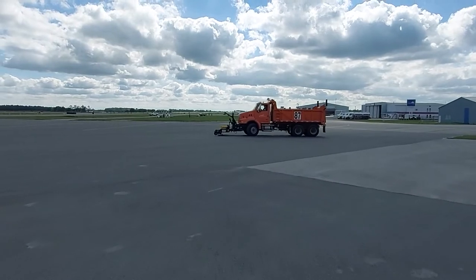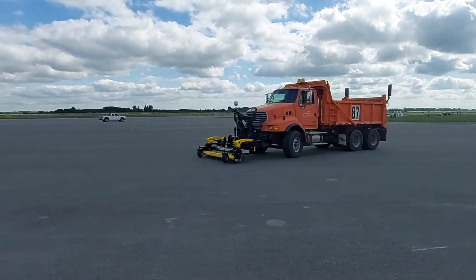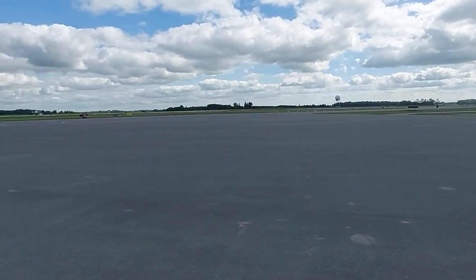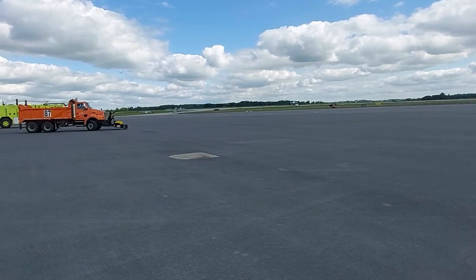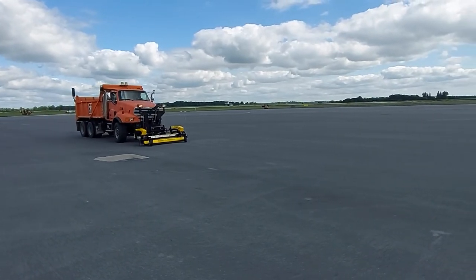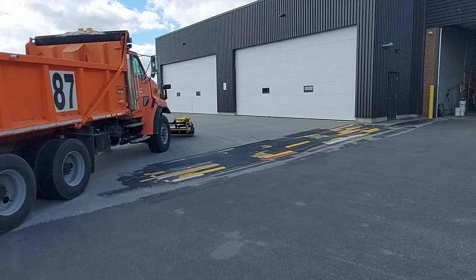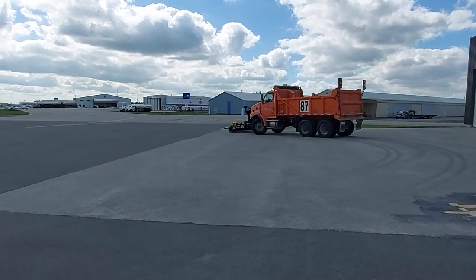This Baffin was designed for road use but it's also very applicable at an airport. These guys have bristles from snow brushes all over the runway and it's hard to pick them up with anything except a magnet. For road use, you can see how fast we can cover ground while still picking stuff up — if you're working on a shoulder following a painting truck or a vegetation unit cleaning the ditch, this thing can follow right behind them at whatever speed they're going and efficiently pick up any nails, bolts, tools, or whatever's out there. Keeping the shoulders clean, keeping emergency vehicles going, keeping the areas and roadways safe.